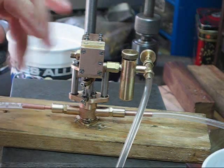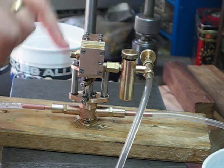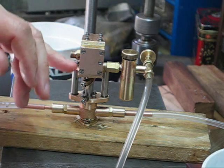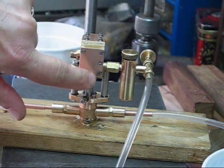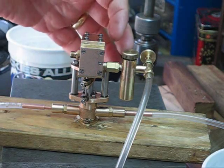The ports actually work the other way around compared to a normal engine. The inlet port for going to the top is actually at the bottom, and vice versa. When the port opens to pressurise the cylinder, at the same time it moves a spool valve up here which opens the port for the exhaust.